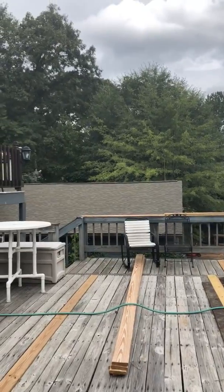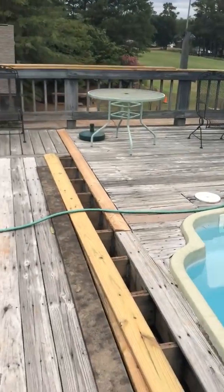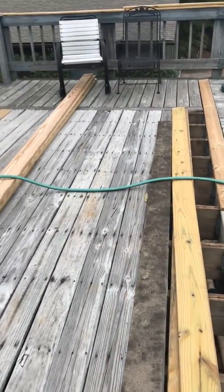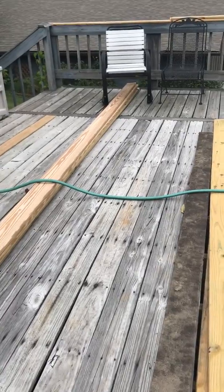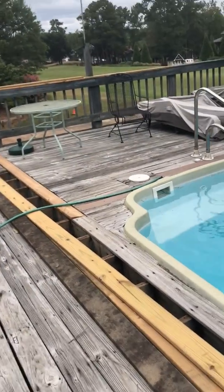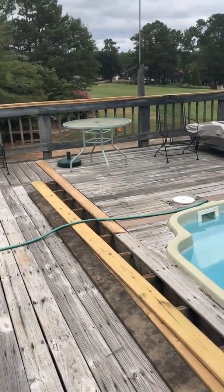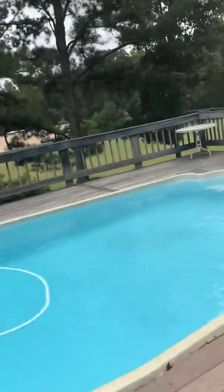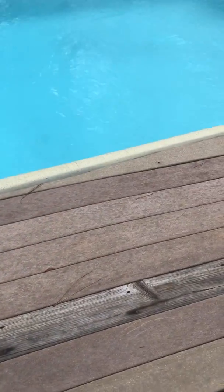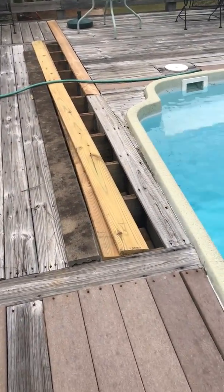There are a lot of lead-service companies where contractors pay for leads, and the service isn't guaranteeing quality. You can see this is Trex material right here — this is older-generation Trex, and one of the reasons I didn't like that product is it doesn't wear well and it'll rot because it was a wood composite. They've done a lot better with the product now and it'll last longer, but we still don't like it — it has higher radiant heat buildup, so in the sun you can't walk across it without burning your feet. Wood doesn't get quite that hot. This right here is second-to-third-generation Trex, and some of it held up, some didn't.